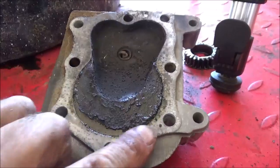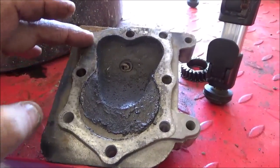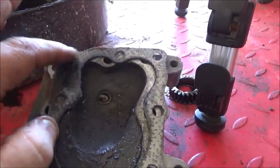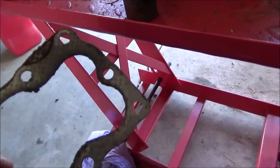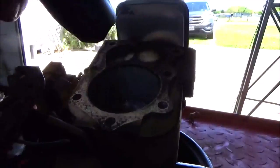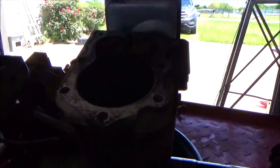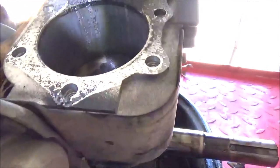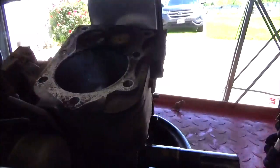See how nice and shiny this is where the head gasket mates and seals — now follow it around to the exhaust valve and see how discolored that is. This gasket was blown right here in the corner. All the exhaust gases were blowing between the head and the gasket. We have got some deep, super deep scoring on the cylinder wall here. Get a flashlight so we can see better. Substantial scoring all the way around — this thing has gotten hot and starved for oil.